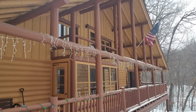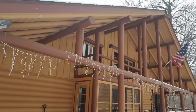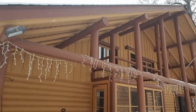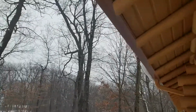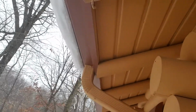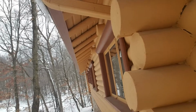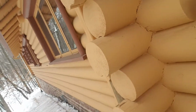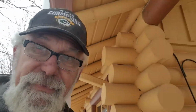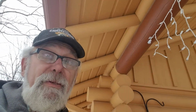Just trying to get all those posts done uniformly, and then do the bottoms of the overhang and the pole rafters, this is going to take a lot of time. The caulking has got some issues where it's failed a little bit here and there, but it's mainly due to settlement, because there isn't very much damage towards the bottom of the building where there's the least amount of settlement. So anyway, it's going to be a spendy job, as we'd say.